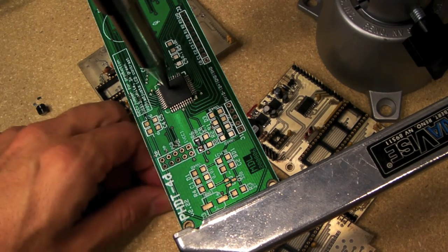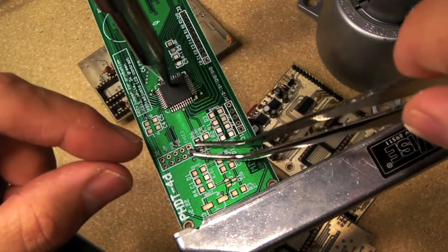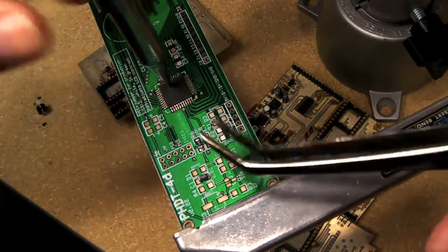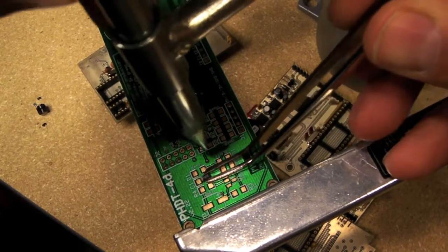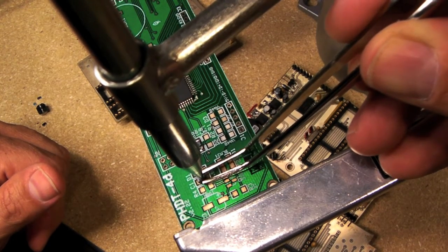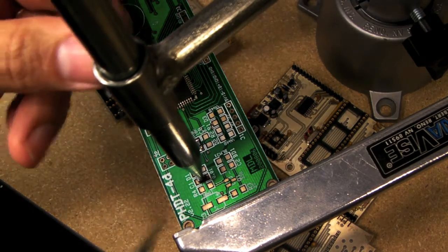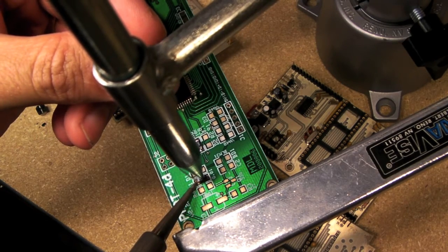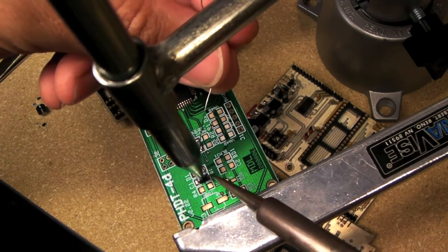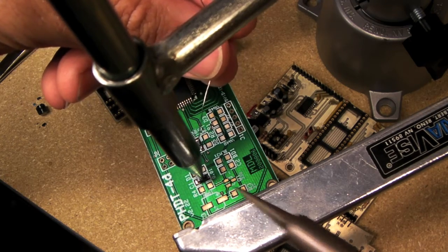Now what I'll do is I'll actually solder one of these capacitors on. This is a little one. And again, I don't really know where this goes on the board, but I'm just going to show you as an example. So that's where we're going to put it. So what I'll do is I'll just hold it, place the Stinger on top of the component, position it like so. Grab our soldering iron, get some solder here, and then what we'll do is just set the soldering iron on the pad, sucks it up, come around and do the back side, like so. That one's on.